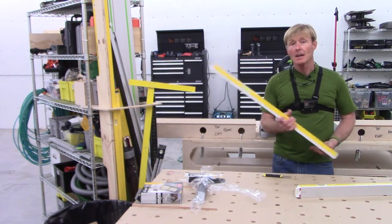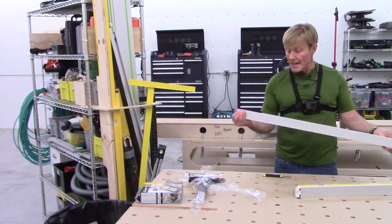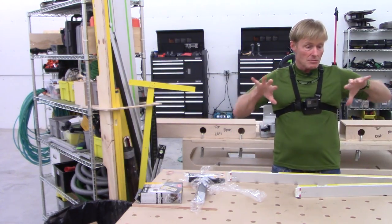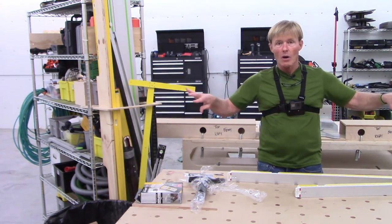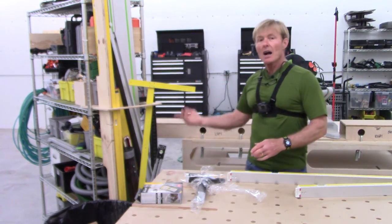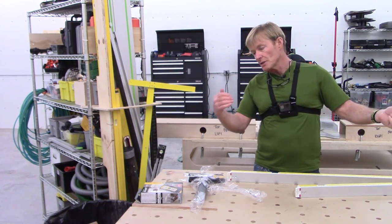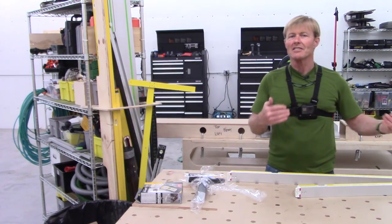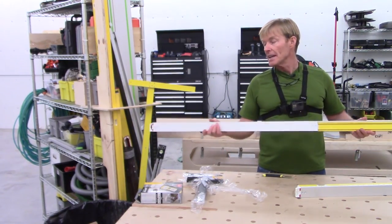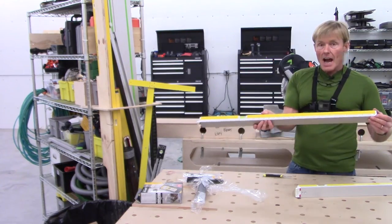So space and money — and also when I take this 36-to-59 level into the job, I'm carrying just one and I can set it specifically to what I need. You know how it is if you're at a windowsill, for example, where you want to level edge to edge — oftentimes your level will be a little bit too big, so you pop it out of the corner so it sticks out. You don't want to use a short one because that's not accurate. With this one I could pull it out and make it exactly the width of my windowsill.